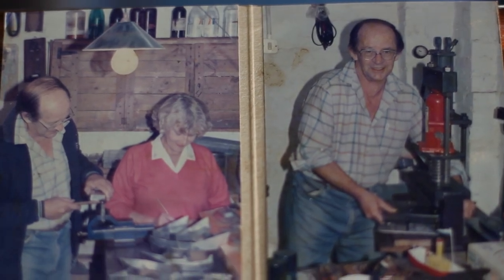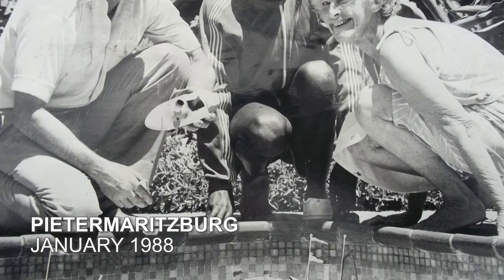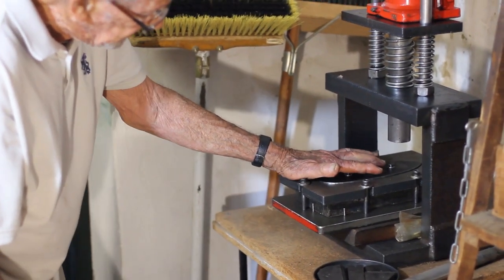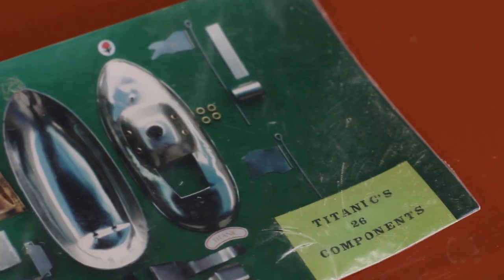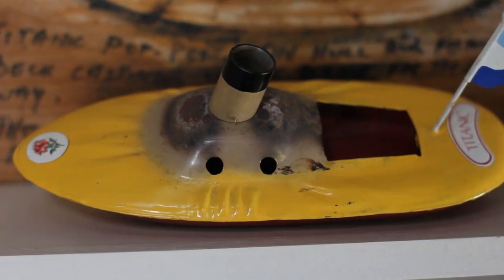We were living in Pietermaritzburg and I started the construction in the workshop with Rose. We had the pool for testing the boats. Of course I had to learn about tin plate — the various thicknesses and the tempers of tin plate, how to press tin plate, and I had to make the dies to press our first little boat out. It was a very simple little model pressed out in two parts and joined together, and that was our first little model which we called Titanic.